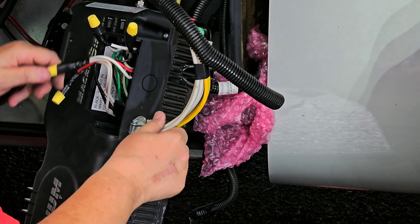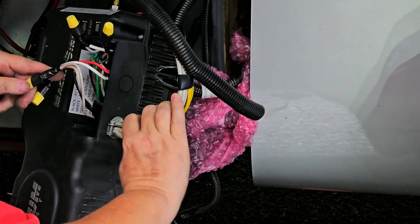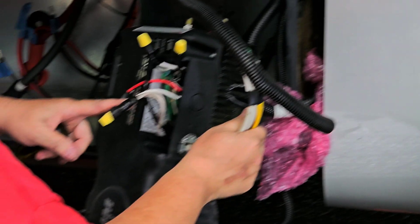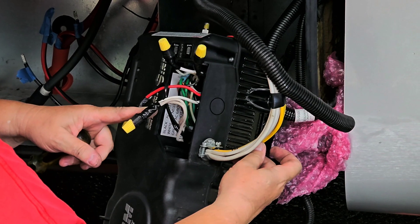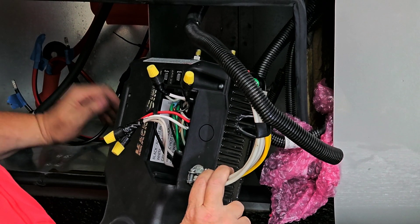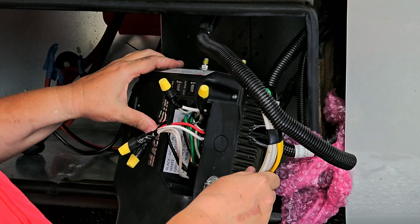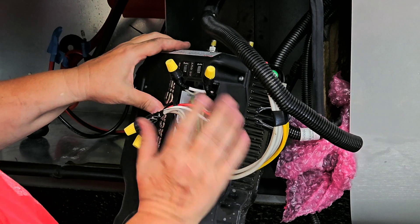What we're going to do is remove this and put the three yellow wires — white, black, and bare — and wire these together in parallel to complete the circuit. The yellow is connected to the breaker, so when you hook the white — which is the output — together in parallel, that completes the circuit to the breaker. Then we're going to attach that breaker to the new inverter bus bar, so the outlets on this circuit will be powered by the new inverter.